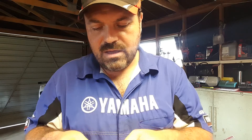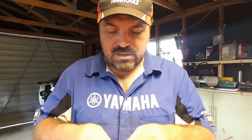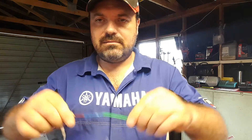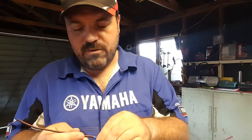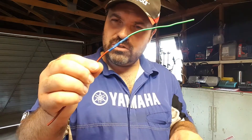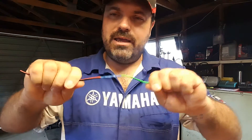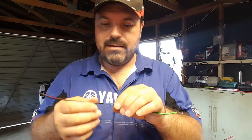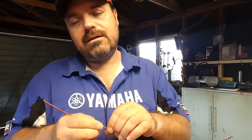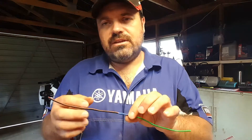If your fingers are clean there won't be too much grease affecting the stickiness of the tape. You don't have to use the whole lot — if you've covered everything and you're happy, it's usually the tail of the tape that's lost its stickiness because you've been touching it. Just break it off or use scissors, roll it round, and that's not bad coverage — it works, it's cheap, and it's quick. For most applications it does the job. Because I've soldered this joint, the tape is in no way holding the wires together — its job is just to insulate the joint where the bare solder is, because if that touched the car body it would short out.